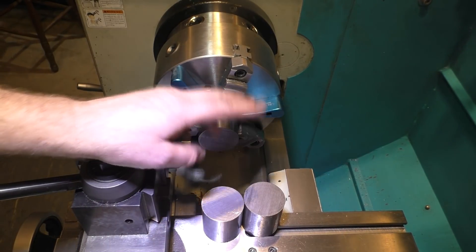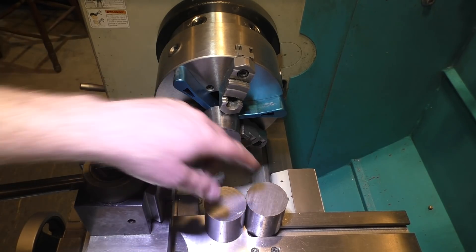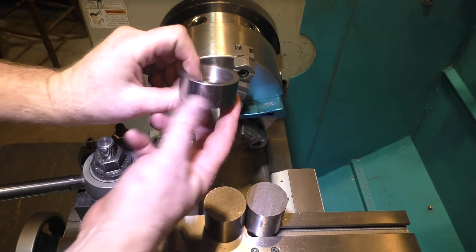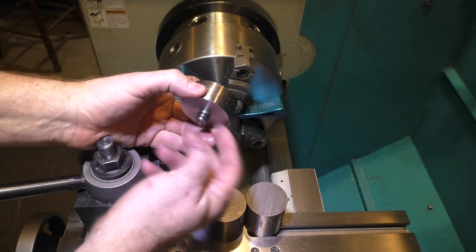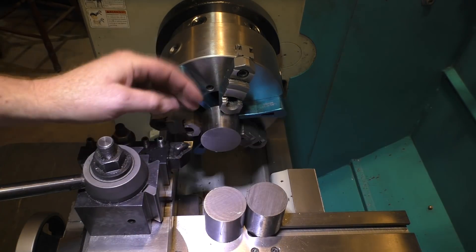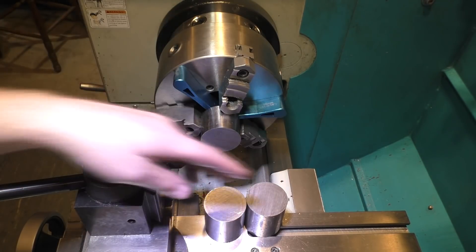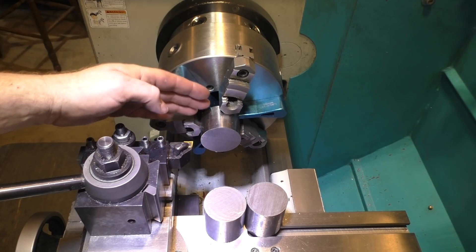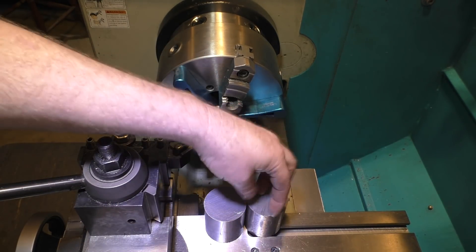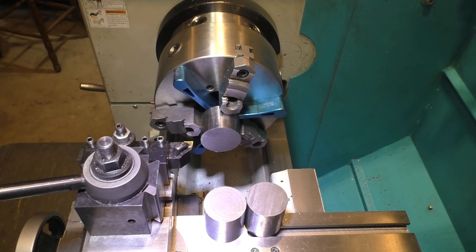Over here on the lathe I've got my three pieces. I put the three jaw chuck in because there won't be any operations requiring concentricity. I'm going to face all six sides of these three pieces. One piece replaces my adapter for the hydraulic press — the ram fits in there and gets tied down with a set screw. I want to make a flat presser piece, hollow it out like the existing one. The other two pieces are the load cell press plates, one for each side. Once faced, one side will be flat and done; the other will need the indentation or the threaded section.